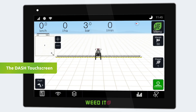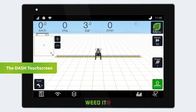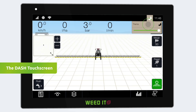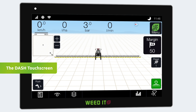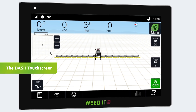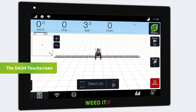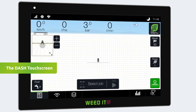Back in the home screen, system functions — 4G LTE, GPS, Wi-Fi, and light/dark mode — are accessible at the top. Icons on the right-hand side offer manual control of the spray margin and change the detection sensitivity. With the master switch, the spraying system stops completely. On the left-hand side, a mini-map is shown; tapping it switches from main view to top view and back.